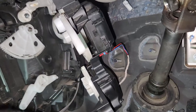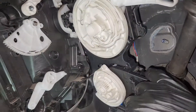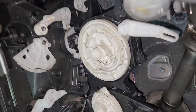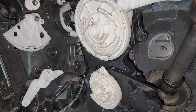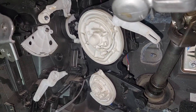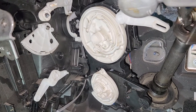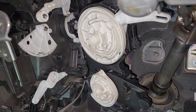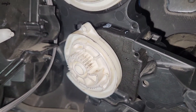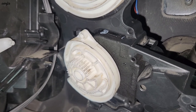After that I plug in the servo motor to check it manually. When you press the button, the top one is working but the bottom one is not moving. So this servo motor is faulty — we need to replace it or fit a second-hand one.